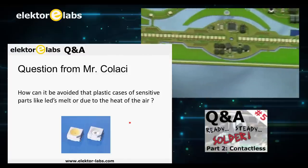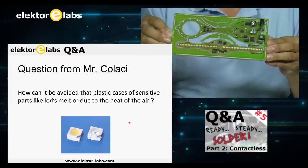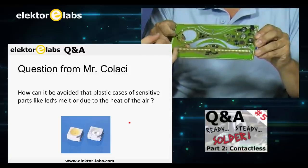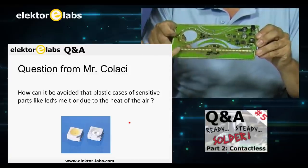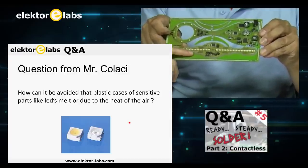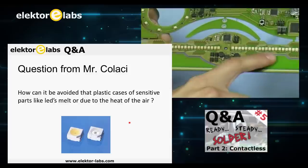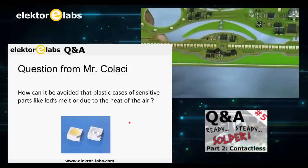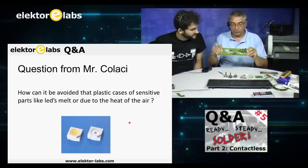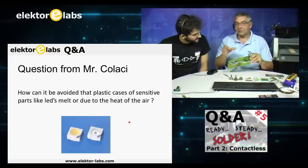As you can see here, this is one of the LED clocks that I made, one of the first. What do you notice? These LEDs are more brown than these ones. It's a bit yellow, a bit burnt, like toasted, and these ones are actually brighter. In the camera it's really difficult to see, but I think it can be seen. I did this PCB in two rows, and in the first row I put on these, and then I had to lower the temperature because I noticed that they were getting a bit browny.